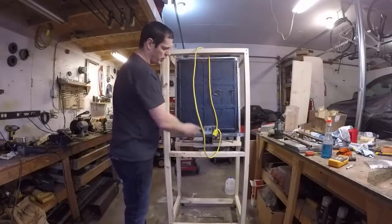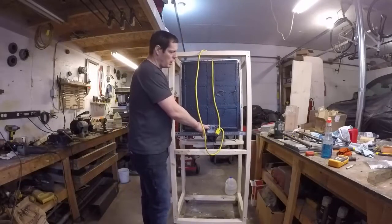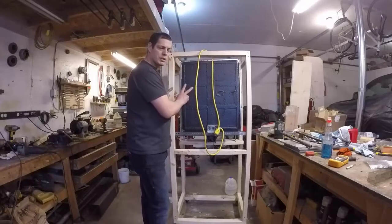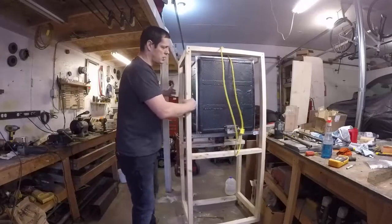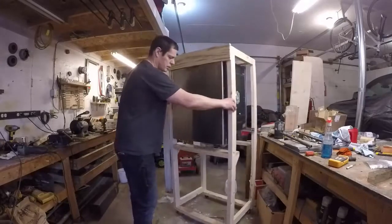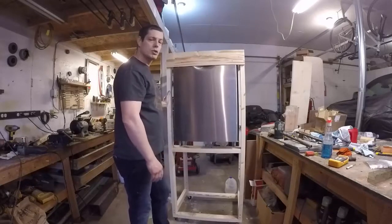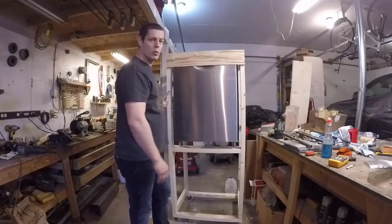As you can see, we have our electrical outlet. This will be wired into a PID controller for temperature control, and we'll have a temperature sensor inside — which will be right in the top. We will also have an external monitor that measures the meat temperature inside so we don't have to open it up once we start.